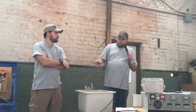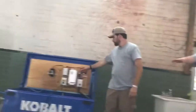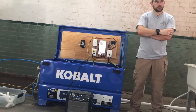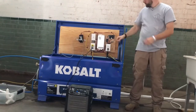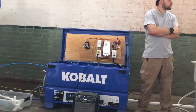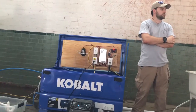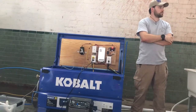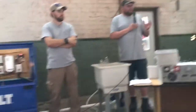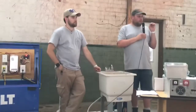We added the dispersion on the bottom of the ozonator here where we got it in the box so you could see it instead of the bottom of the tank. There's little diffusers on there to make the water go out. We were pumping ozone in the tank and you could smell it in the tank. But those diffusers made it better. And we looked at that based on one customer that her whole tank had a lack of oxygen in it. Even though it had the ozonator, it just went too fast. You could open the lid and smell it. It was like you had natural gas or eggs or something sitting there. But we put that in and it's fixing the problem. It makes it not do that.